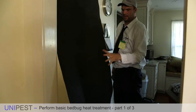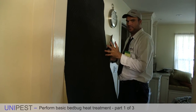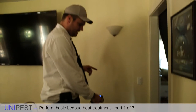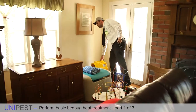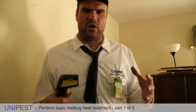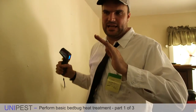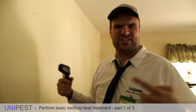As you can see here, this moving blanket is getting pushed out by the amount of air going in — that's really good. It means the system is functioning healthily. Let's go inside. I'm going to do one last check of the temperature on this duct — it's at 140 degrees, which is about where I want it. So I'm going to now go around and turn on the fans. Once I have all of the fans running, I'm quickly going to check the temperature of different parts of the room to try and see where the coldest area is. It's not until the coldest area in the room is at 120 degrees that I know the room has reached lethal temperature.